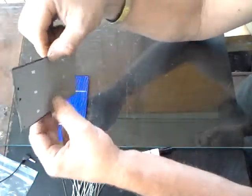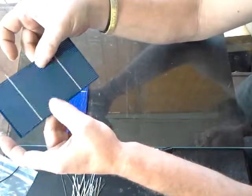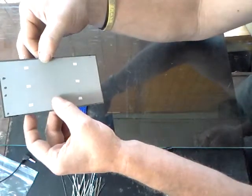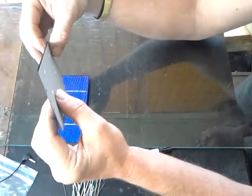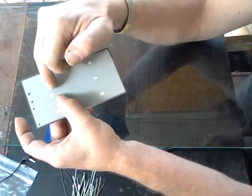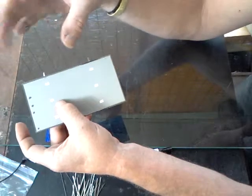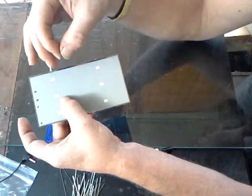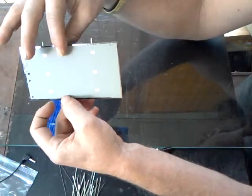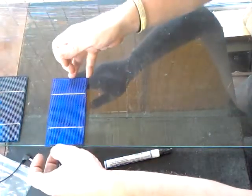It's long and drawn out, so you might be better off going with a pre-tabbed cell. The downside of some of these cells is that they're recycled or refurbished — pulled from large panels. In cutting them, those wires get deformed, and in the process of cutting, stacking, or shipping, the cells will crack. With thermal expansion and contraction from being in sunlight, they will eventually fracture, diminish in power, and if fractured enough, they will break the circuit, stopping your solar panel from functioning.